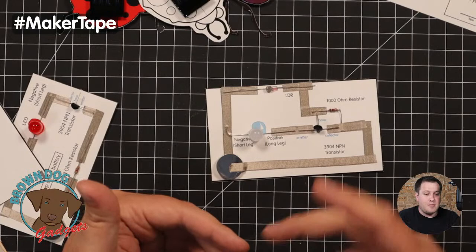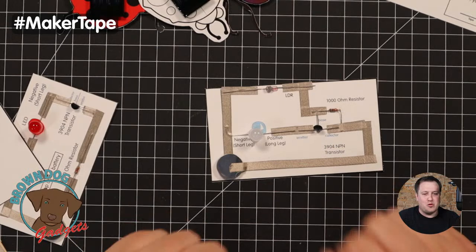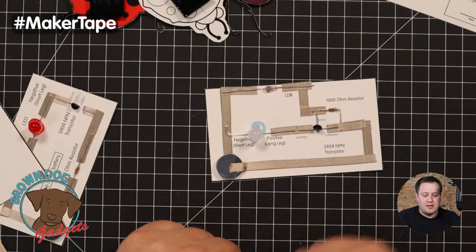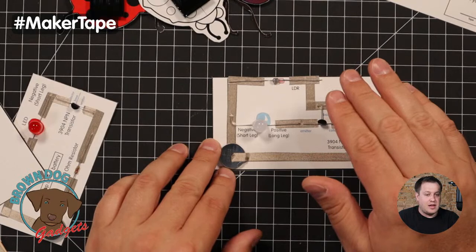You'll find your single battery, usually a single 1.2-volt NiCad. Really, really low amperage, it's cheap. There's not much power storage in there. A single LED and a little transistor setup, usually a 4-pin. I don't know what it is exactly, but it's like a 4-pin transistor setup. And they use a solar panel as your sensor instead of an LDR, light detecting resistor. The nicer ones, you can actually see the LDR on the outside of the case.